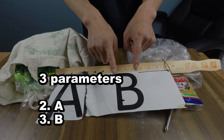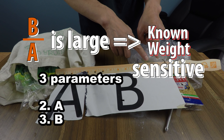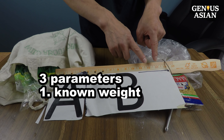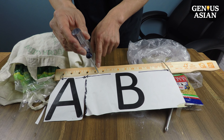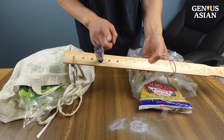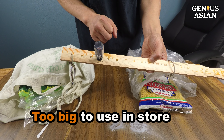If the ratio of b over a is too large, then the known weight is pretty sensitive to change, so the known weight needs to be pretty accurate. Also, to be more accurate, you can choose one of the holes to put the screwdriver through so that both distance a and b are large. This device is nice, but I would be embarrassed to use it in a store.